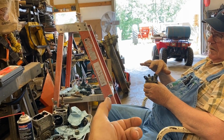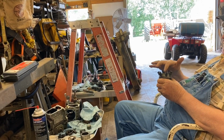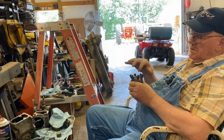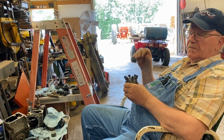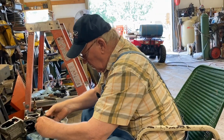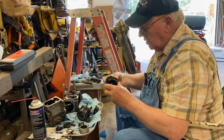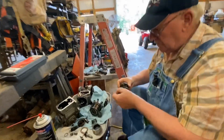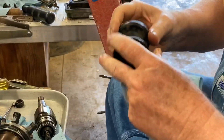So basically, that's your thumb going over the end of the water hose starting to build pressure. It's starting to build pressure at that point. And your flywheel timing on the engine should be at 28 degrees before top dead center. And there are marks on the flywheel that show that. Also, when you get it at 28 degrees before top dead center, there is a mark on here, if I can find it. I think I felt it. There it is right there.